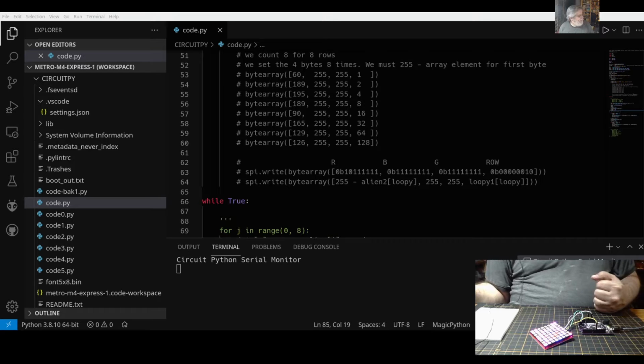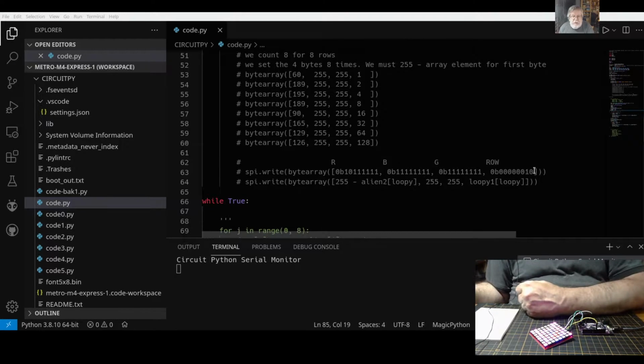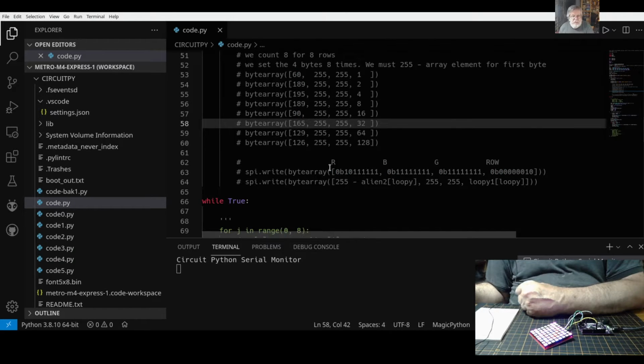So, big endian is the order in which the most significant value of the sequence is stored first, at the lowest storage address. Little endian is the order in which the least significant value of the sequence is stored first. So in this case, you are pushing this byte right here, that 0, for example, then a 1, then a 0, and so on, going all the way over to here. So we are pushing 32 bits into the 4 shift registers.